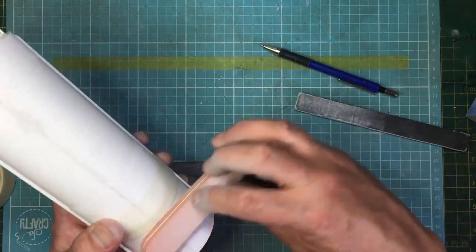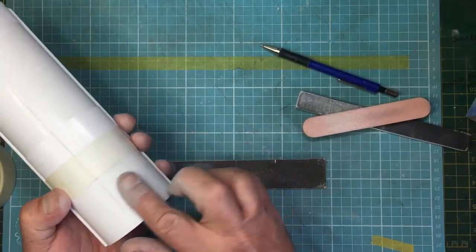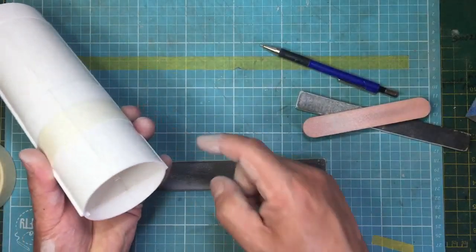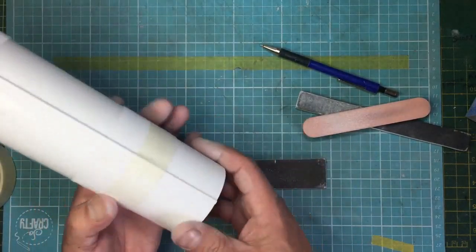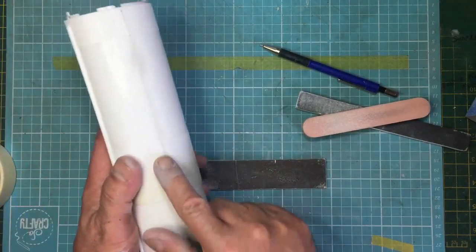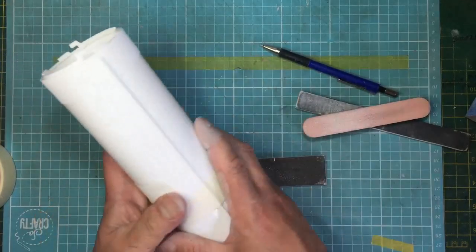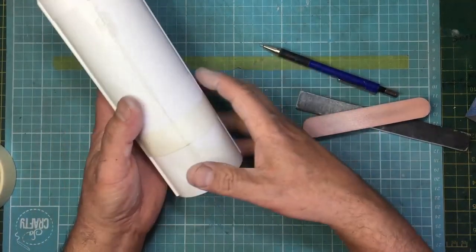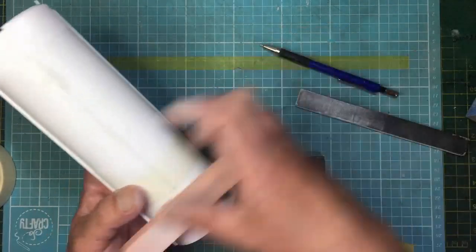So there we go, guys. I'm pretty much there now. Like I say, ready to start using a guide coat. I don't want to just start sanding, because this is white plastic, it's very difficult to see what you're doing. And for all I know, I could be putting a massive flat on there about that wide, or a hexagonal sort of shape. So I'll put a guide coat on there that I can work with, and then I'll be away. So I'll get the rest of this done, and then I'm going to start looking at how to do this. So what I'll probably do is do one or maybe two sides and then show you how I've done it, rather than have you watch me experiment in the wrong way. There's no point showing you the wrong way. I'll tell you the wrong way, but there's no point in me doing a half hour long video on how to do it wrong.